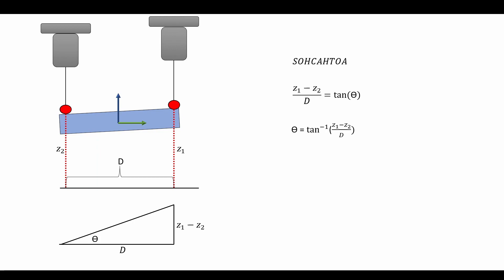We're going to go over this PowerPoint slide to describe how the probing routines work. The first assumption is that you've run the A axis center of rotation routine, your stock is in the vise, and you've switched from G59 back to G54 and set X, Y, and Z zero. Your center of rotation has already been entered and you're ready in terms of where you think the center of the stock is. Now we're going to correct for errors in the angle of our material and in the center of rotation based on the slight variations that our limit switches can introduce.